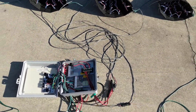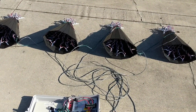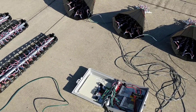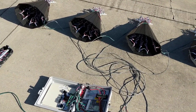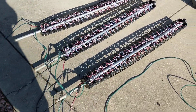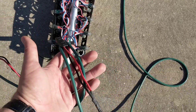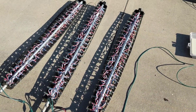It's not that complicated once you really get down into it — it's just not something I see a lot of people doing. People tend to buy F16 controllers and run multiple individual strings to a prop. I wanted to explain how my method works, keeping the display neater and easier to swap out. Every single one of my props follows the same convention: a pixel in, a pixel out, and a single power connection — and inside the prop itself is where all the power injection takes place.